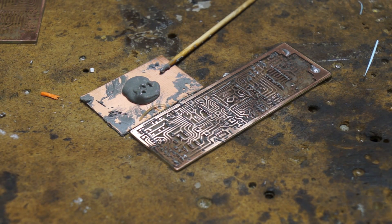All right, that took about six, maybe seven minutes. I have mostly done. I may have missed one or two pads, and if I did, it's really not a big deal because I can just go back as I'm placing the parts and add some extra solder paste wherever I need it. So now I'm going to start placing the parts.